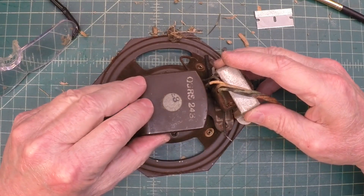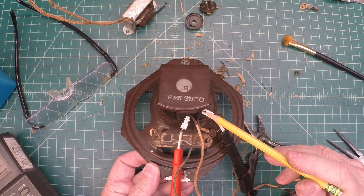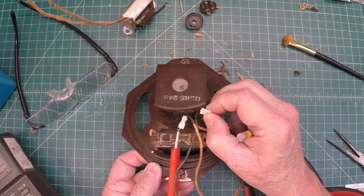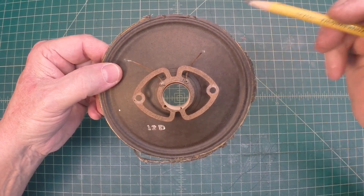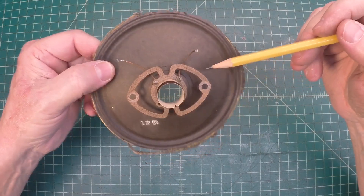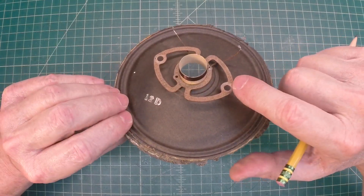I've got the ears bent back here — I was able to get a small screwdriver pried underneath those, and I'm just trying to get this output transformer out of my way. I took the leads again and made certain they're going through their little metal grommets. Still nothing — I saw some resistance for a minute, but it was actually my fingers across the probes. Let me recap what I've got done today on the speaker. I've got the cone out. Here's the spider itself, for folks that haven't seen the old-timey spiders in speakers — thus the name, you can see it looks like a spider. The two leads coming off of the voice coil still need to be checked. It checked good hooked up to the humbucking coil, but we'll test that before we go too far.